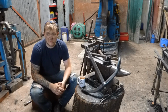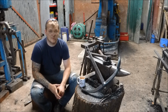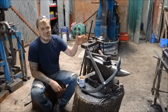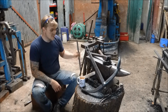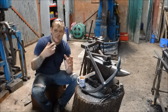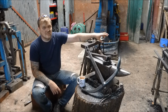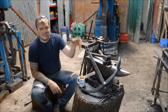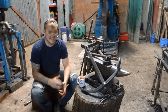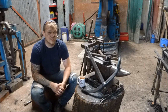The other option, this is the one that I would like to do, but I kind of see it as a bit, they're both a bit copy out, is I'll forge a large hook with a shackle and a swivel, and then the remainder of the weight made up in chain, 20 mil chain. So basically that would be a five kilo hook, shackle and swivel, however that comes out. That would be quite a large hook and quite a large swivel and everything, and then 15 further kilos of chain. That is a lot of chain. That's a lot of fire welding, that's a lot of hard work, and I'd like to get that all done in a day. The chain anyway, so one episode the hook, the other episode the chain, and that's basically what I'd like to do.